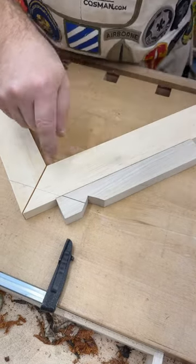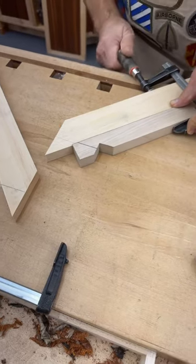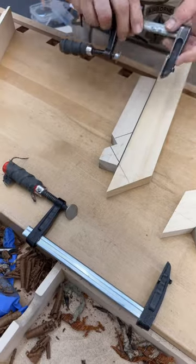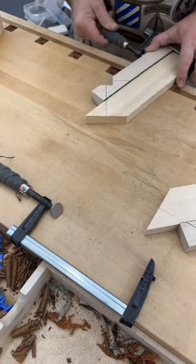Draw lines to put marks through the middle of the joint. You're going to clamp lightly, each clamp, one on each side. Don't leave marks in your wood — if you have to, you can always put something in there to protect it.